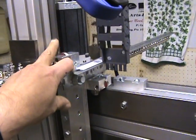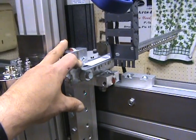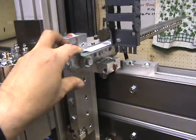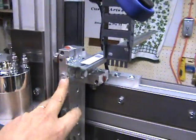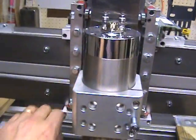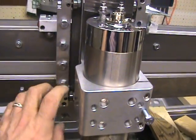One thing I want to point out real quick: since I had the Z-axis all disassembled, what I did was I took the steel plate prior to mounting it to anything. I removed the lead screw nut from the back of the Z-axis plate, and then I took out the two middle bolts on both sides — the top one and the bottom one I left solid because this was my datum that I set up to be square.